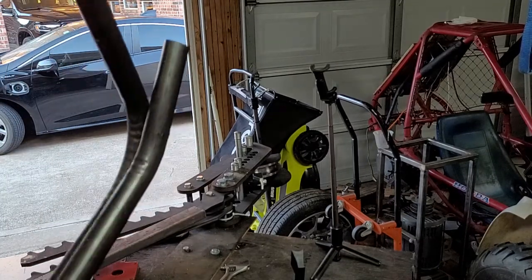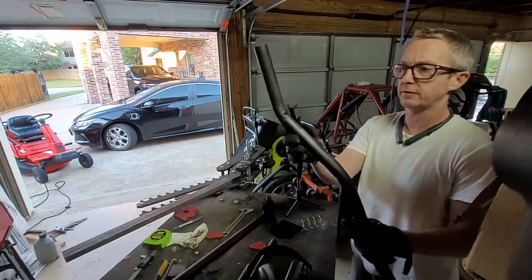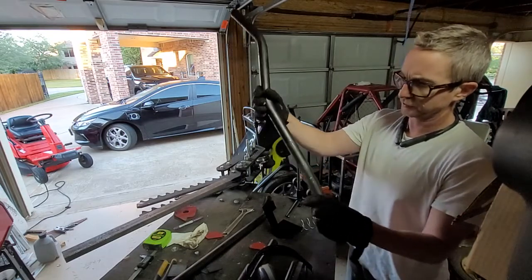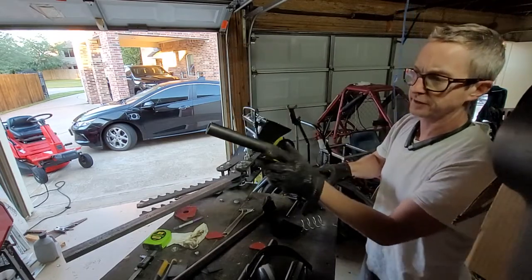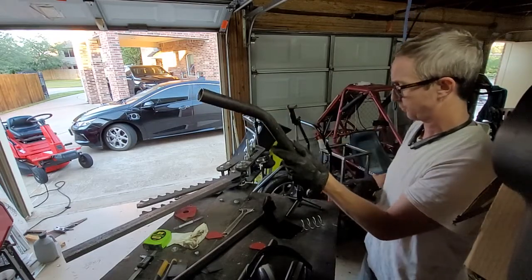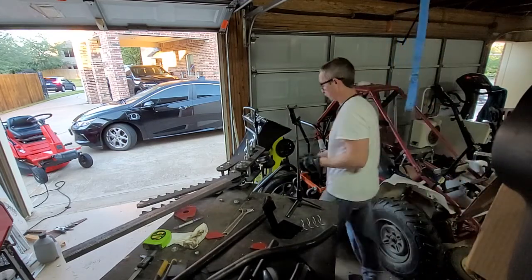So, I had crinkles right from the get-go on that one. Here's one of my other pipes that I just threw away, basically. So yeah, look at that right there. That crinkled up in no time. This one, and this was just a slight bend that I did, and it looked okay. But yeah, this is what I really could tell. It flattens out this side right here. All right, well, cool. Now I can do the other bend and get one part of my frame done.